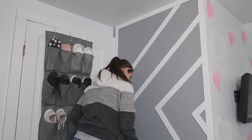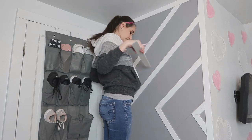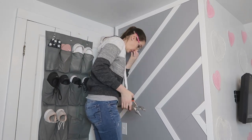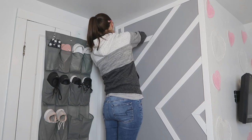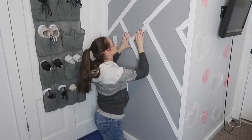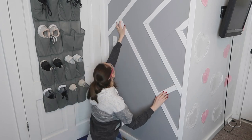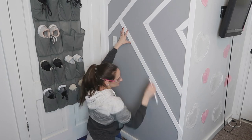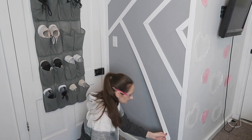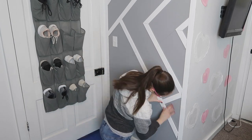For the top part I got creative and added a couple of horizontal trim pieces, so I wouldn't have everything at an angle and could add some contrast. For longer angled pieces, I suggest sticking a nail into one anchor point first — I did this at the top — so you can run your template to the top, add a nail, and then the bottom end is still moveable. Once you have it positioned where you need it, you can secure it with more brad nails.